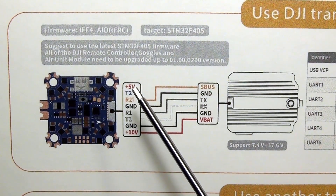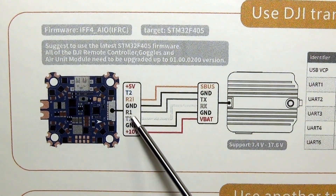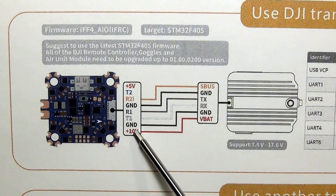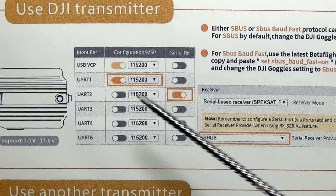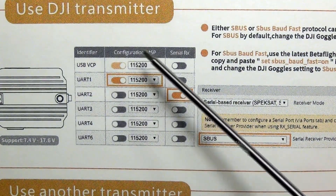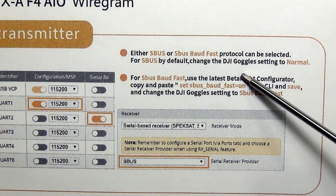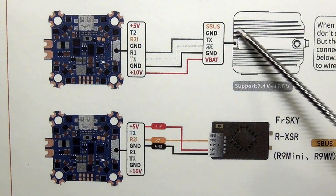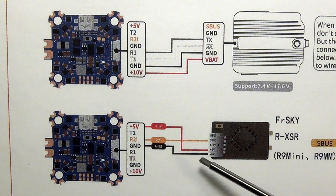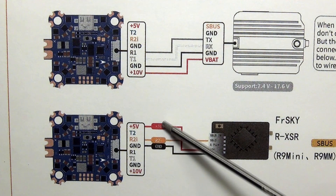Taking a quick look at the wire diagram: you can see 5-volt out, T2 for transmit, R2 for receive, ground, R1 receive, T1 transmit, ground, and a 10-volt pad — that wires straight up to your DJI air unit. With this configuration, you'll be using UART1 in MSP mode and then SBUS/RX on UART2. Make sure you have it set to FastBus if you have your DJI air unit set to FastBus as well. Other configurations include hooking up the air unit for video and having a separate transmitter using the same pin header with those additional wires.